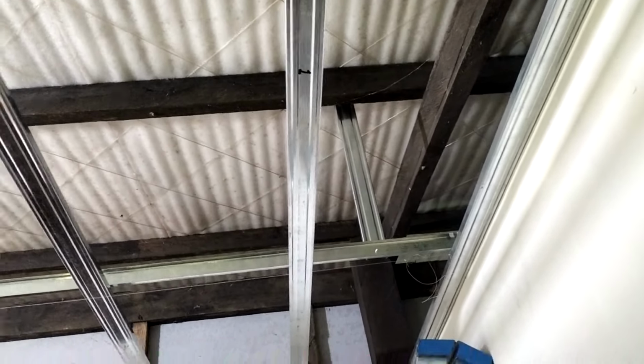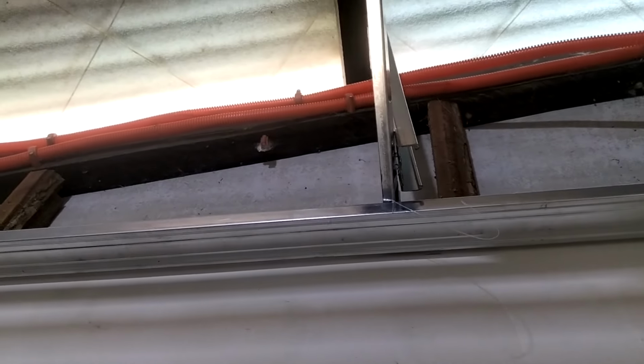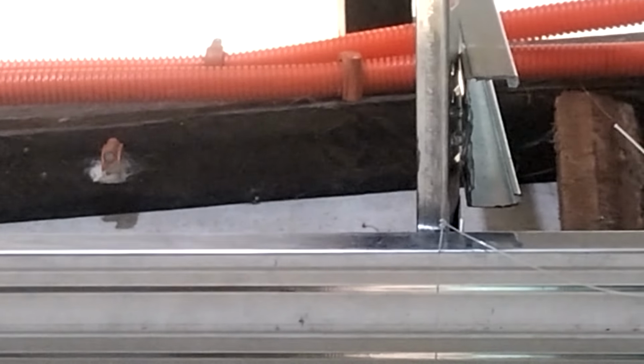Well, that's the one I installed the best, I think. I like this one, it's good. Nice and sturdy. I need to redo the other one, on the other hand, I'll show you why. See, I didn't use that G-clamp, but look in between. It's not tightened together, it has a gap. So I need to redo this one and put the G-clamp. Yeah, no good.